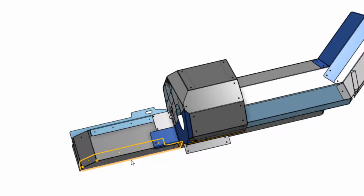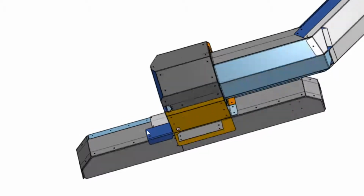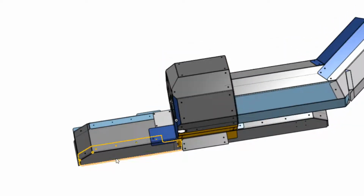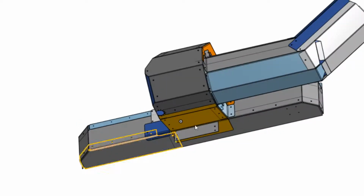It's a sand cast piece of the block that runs the length of it here, and so they rest on top of that. And although the pieces aren't shown in this one, there's a bracket that'll go on the bottom here, held on with screws, that will overlap a tapped hole down here, and we can use an 8mm bolt to hold that one on, and it holds the bottom of the enclosure to the block.